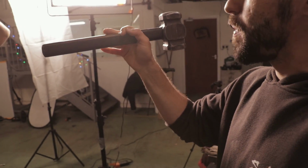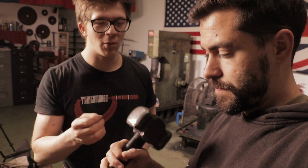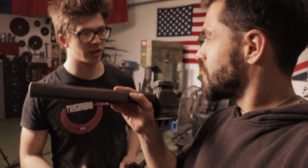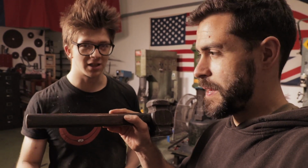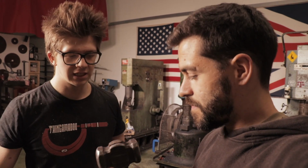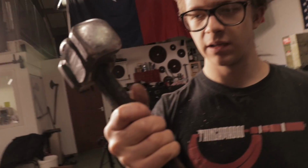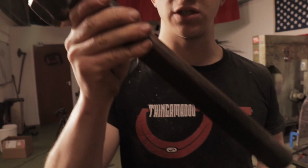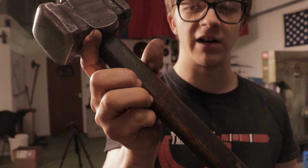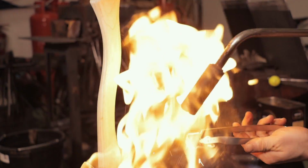And you were telling me you burnt it in with the blowtorch, really. Absolutely, use the blowtorch, because the trouble is they're trying to just finish the outside of the wood, but what we're not trying to do is actually cook the thing. And damage the wood, right? Yeah, absolutely. So the blowtorch is so hot that we just quickly, I mean, it takes like 5 seconds, quickly burn the surface. Awesome. Then we can oil it, and it ends up this really nice, tough, beautiful, soft satin finish as you use it. Get some beautiful color in it. This one's hickory, but it ends up pretty similar with the ash.